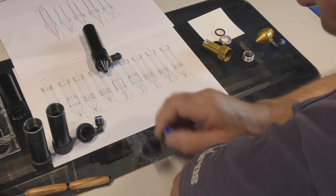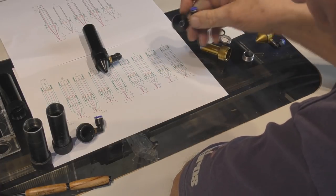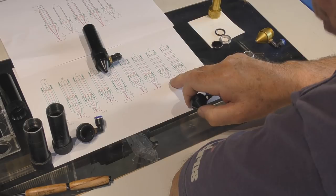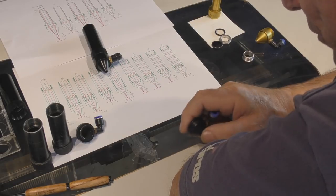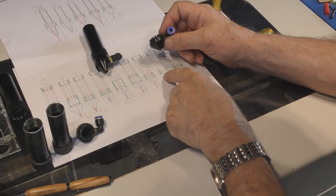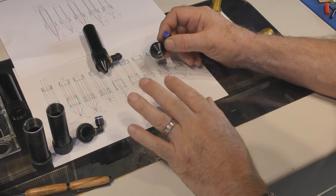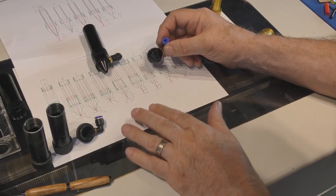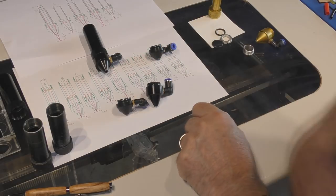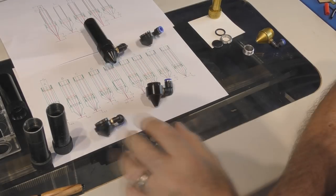Now it doesn't have to be an eight-millimeter hole — but if you're using a one-and-a-half-inch lens for engraving it just about passes through an eight-millimeter hole. We haven't yet done the work to prove whether for an engraving lens the engraving will be better if we put an occlusion and limit the power coming out of the nozzle. The jury is still out. These nozzles have been around since the flood and nobody's complained about them so far — they can stay like they are until those discoveries are made and we can make the modifications ourselves.